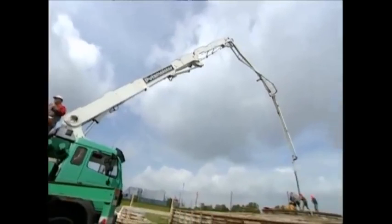Workers then join the halves together to make a single hollow blade. To simulate the effects of strong winds over a 20-year period, they load a test blade with a weight of over 50 tons, then shunt it from side to side an incredible 5 million times.